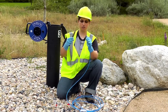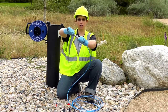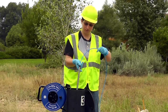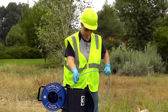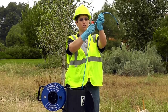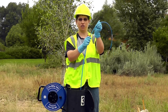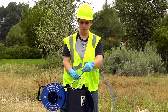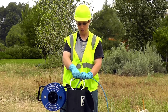To connect the Level Troll, match the flat sides, push straight in, line up the barbs, and twist until you hear the click. Now we're going to lower the Level Troll into the well to the final deployment location. Once you've reached the spot where you want to leave it, you can move the service grip up and down to the final location by pressing together on it and pushing whichever direction you need to. Then attach the service grip to your well dock and fasten the D-ring.